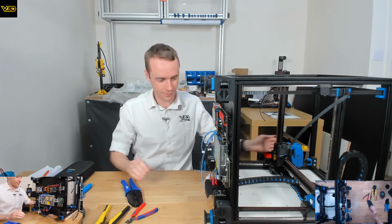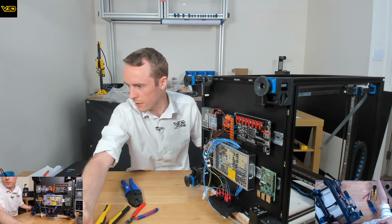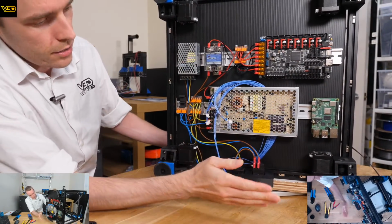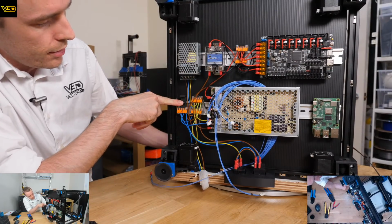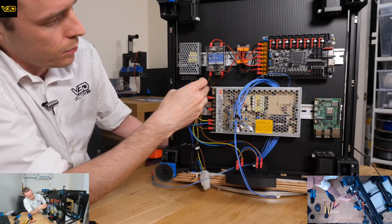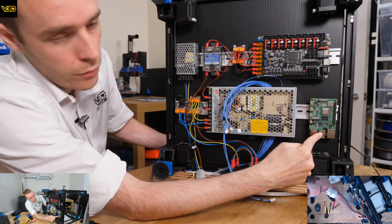So, this is where we're at. It's weird having this big old empty space all the way up here, but anyway, it's looking rather good, I think. Let's switch to this other camera. I think we can see everything a little bit better. So we've got mains all sorted where it's coming in. We mounted all the Wago terminals, link for that part in the description. That's going into the power supply over here, and we've taken out some of that wiring over to the board. We've also, from the Wago terminals, powered this, which is the 5-volt power supply for said Raspberry Pi over here.